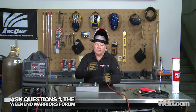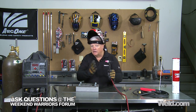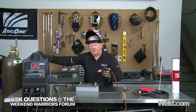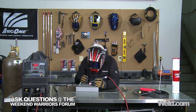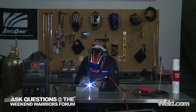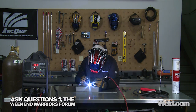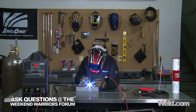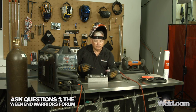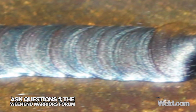I've switched the machine back — now it's correct, DC minus. Make sure you change out your tungsten and put a pointed tungsten back in. If you leave the ball tungsten in, the arc will just wander and you'll have a tough time. I'll verify this is correct with the machine on, gas on, doing a little lap weld on 16 gauge steel with a 1/16th diameter tungsten. You can see it welded nicely.